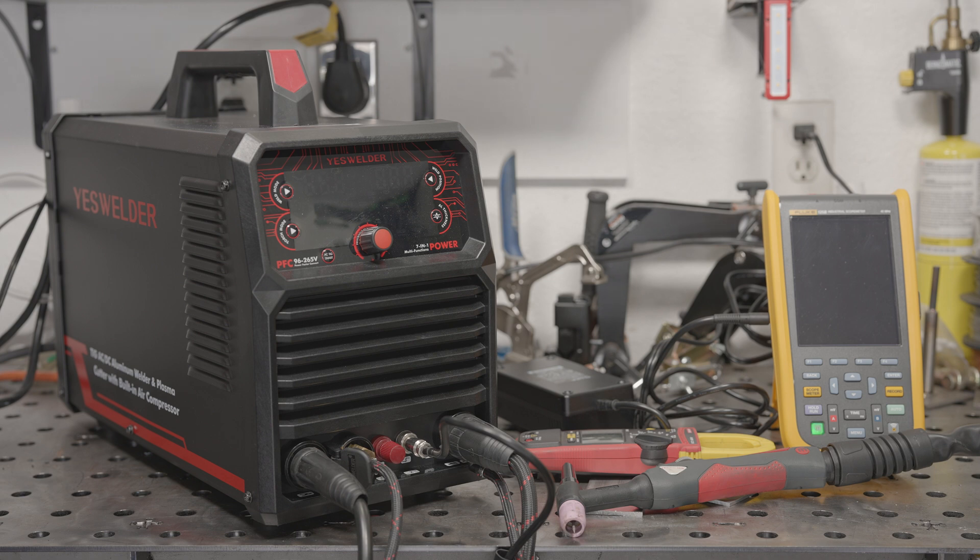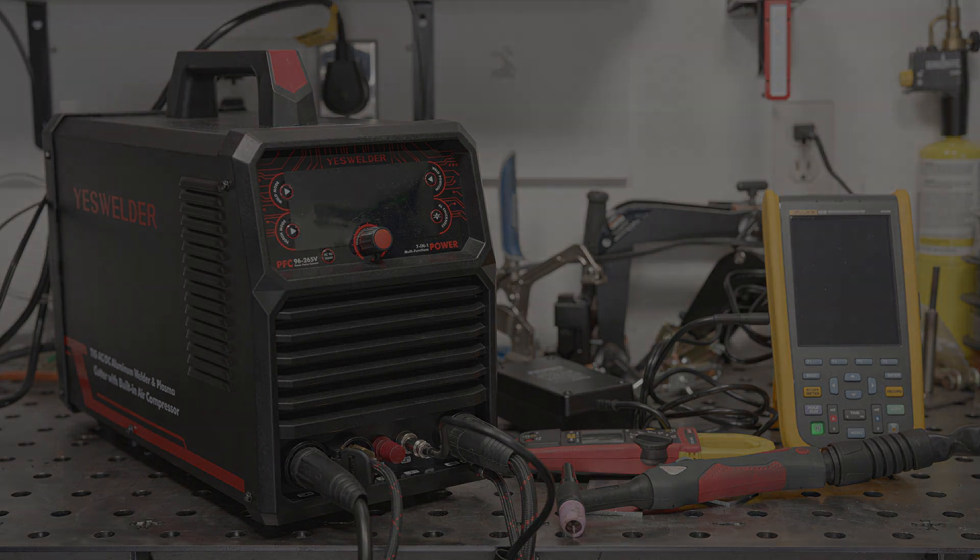And even to get that 176, you can't use any remote amperage control and you have to use a minimum of 25% to 30% electrode positive balance. So ultimately, the AC TIG function of this welder is disappointing. That's it for this one — hopefully that was helpful or interesting. If you have any questions, let me know, and as always, thanks for watching. Take care.